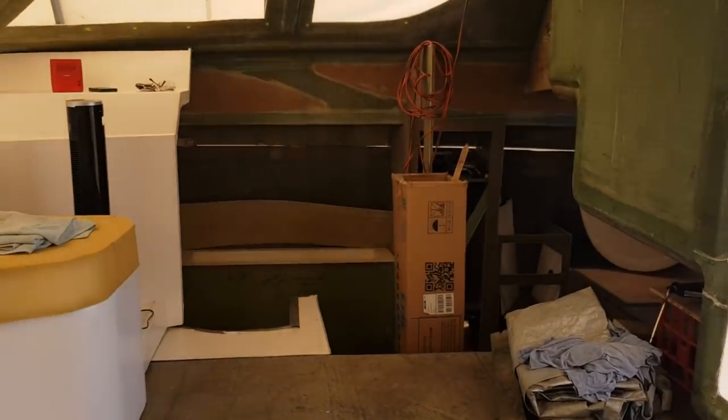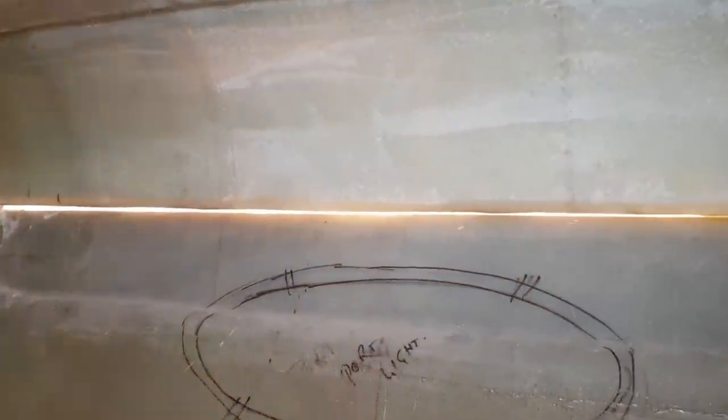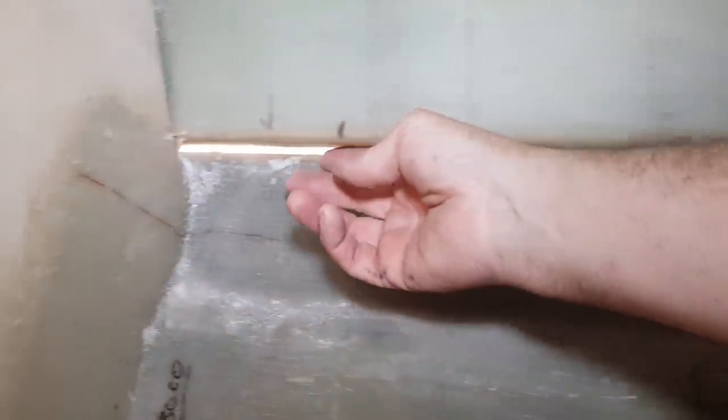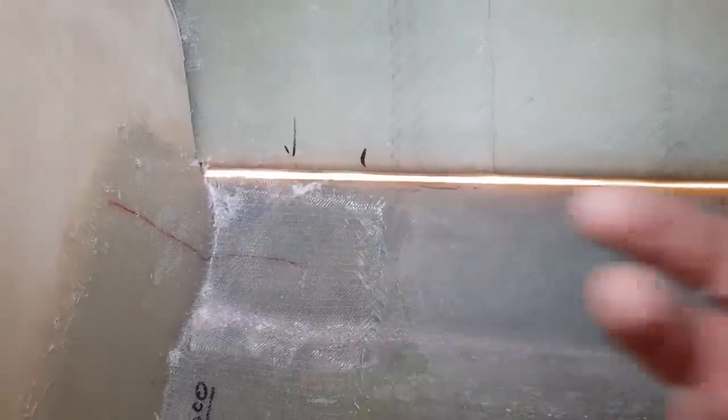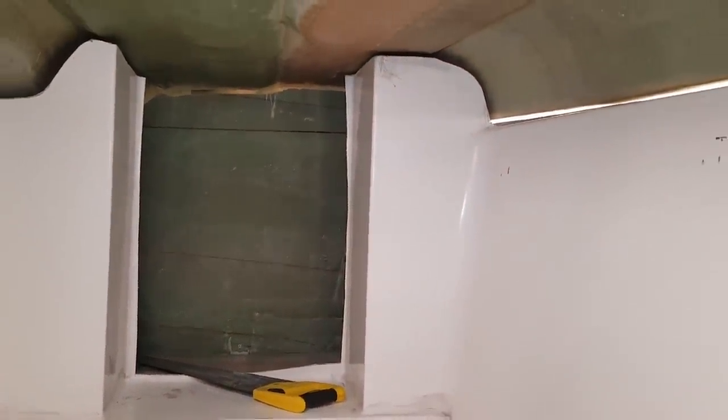It is the same on the other side. I did some measurements and pulled the mould in - if I hadn't have done that I would have had an even greater problem. Over in here, before I start cutting out windows and weakening the whole deck structure, I'm better off to fix this now. Same deal - a couple of wedges in here, drill the hole up in there, and from there forward you can see we're actually losing the seam line. It's quite a marked gap - basically a good 20 to 25 millimeters, and we're actually almost at around 30 millimeters here - over an inch. But by moving that out an inch right from the front I'll get this to fit, repair it from underneath, re-gel coat it, polish it out, and hopefully end up with no cosmetic lump or fairing problems.